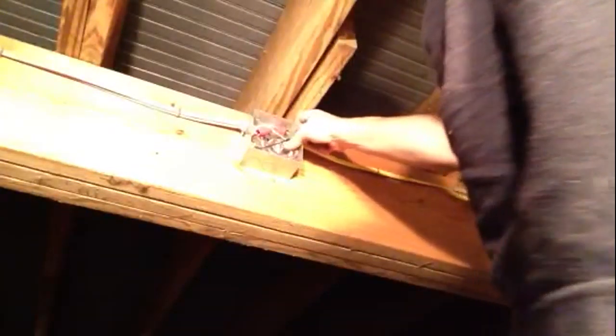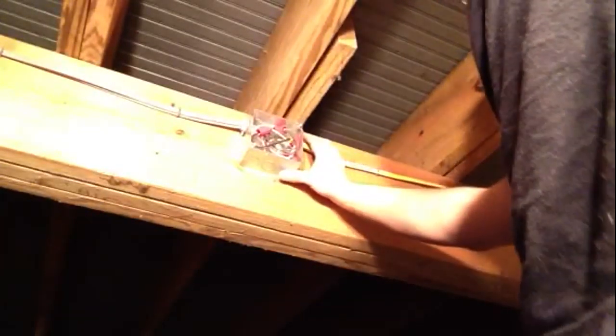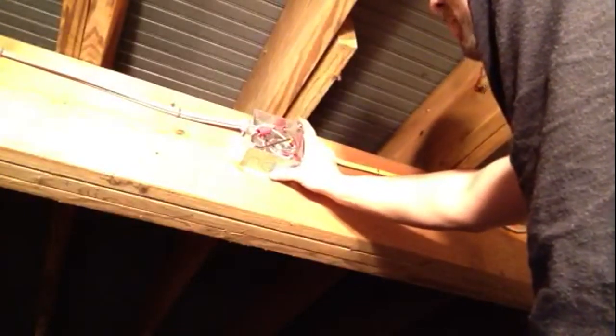I'll say a little bit about my box size too. This is a two-gang corner box. I usually use this for four or five wires. I hardly ever use anything smaller than this size box — four inch by two and a quarter, I believe. You can get a bigger box or put an extender on it. I do have smaller boxes, but the only thing I use a smaller box for is a wire in and a wire out, and that's it.